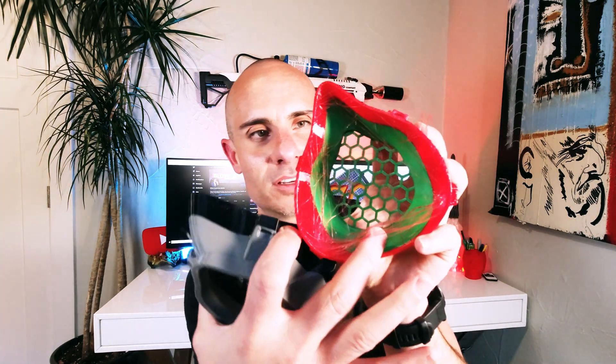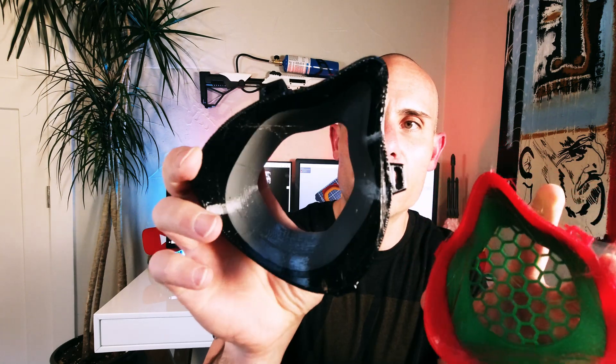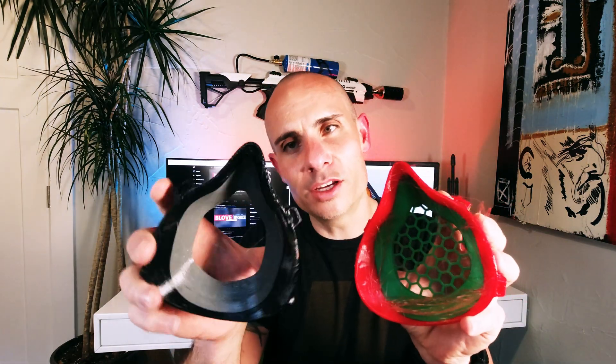How do we actually prevent this from happening in the first place? That's the ultimate goal. We had this original mask — look at that stringy mess, it's really bad. Then we've got this one I just printed and it's not perfect, but I'm going to call this whispering rather than stringing because it's really just a few very tiny fibers. You could literally just take your finger, run it through and they'd be completely gone. You could tweak this further and get to absolutely no whispering, but there are some trade-offs and balances.